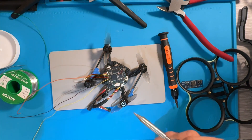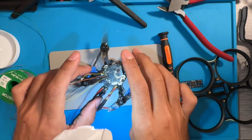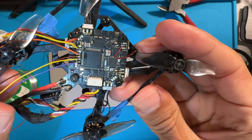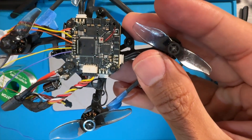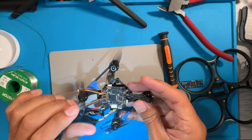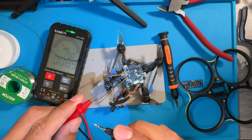The only thing I was disappointed with was that the LiDAR sensor didn't work. I'm just adding more solder to make my connections a little bit more solid so that it just holds. This is how it looks when it's done — when you have all your wires connected. You want to make sure that nothing is bridged. To make sure nothing's bridged, what you want to do is check for continuity. Continuity means you put a wire on one connector and put it on the other and just pray that it doesn't beep. Because if it beeps, that means your solder connection is bridged and you can actually short out the flight controller, which is very expensive, and you could wind up having to buy a new one or blow the whole thing up.